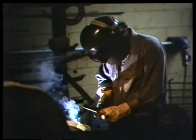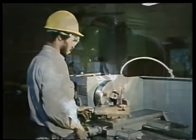Deep cuts or pits that cannot be removed by lapping may be filled by welding before they're machined on a lathe, but it may not be worth the time and effort to try to repair the valve. It would be better to replace the valve. If you find a valve badly damaged, check with your supervisor to determine a course of action.